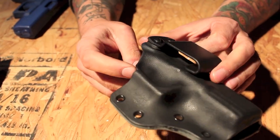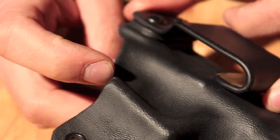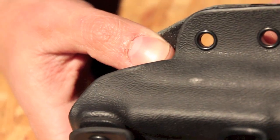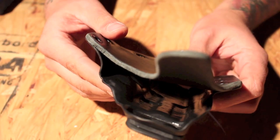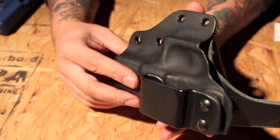I would avoid really sharp right-angle cuts like this. First of all, they're really difficult to finish, and on top of it, right-angle cuts lead to cracks. The right-angle cut there where this starts to come up, and it also sort of starts to do it down here — I'd avoid really tight cuts like that, especially since you're just making it more difficult for yourself. You're not quite getting a consistent finish on everything just yet, so I would simplify your cuts until you can get that down pat.